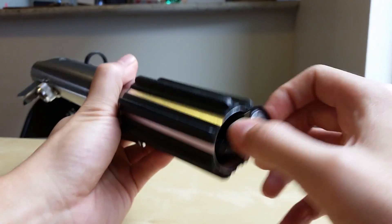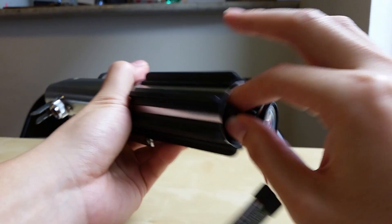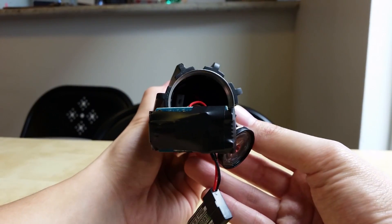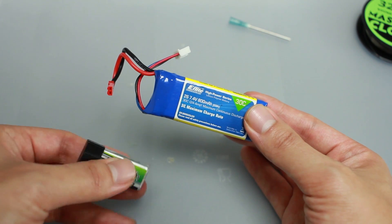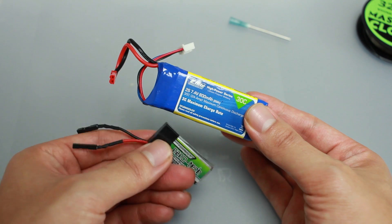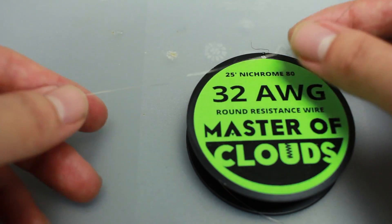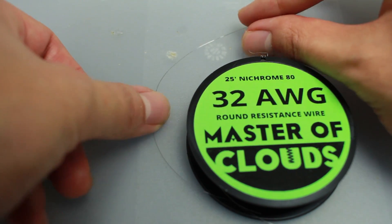Now for the ignition circuit. The original ignition circuit is complicated and was hard to fit in the saber, and only lasted a few minutes before the batteries died. So for this second lightsaber, I decided to ditch the soundboard to try something simpler and dumber. This is a 7.4 volt LiPo battery — it's way beefier than the smaller 3.7 volt LiPo, but should fit in a saber without a soundboard. To account for the increased voltage, we're going to use around 6.5 inches of 32 gauge nichrome wire.